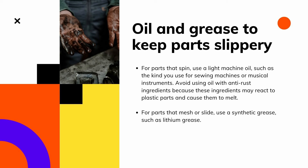Don't use water-based cleaners around powered circuits or you may short something out. Lastly, we have electronics cleaners or degreasers. Use only a cleaner or degreaser made for use on electronic components when applying directly on parts and circuit boards. You can find the cleaner in a spray can and a bottle with a brush applicator.